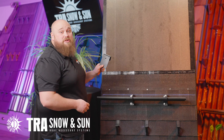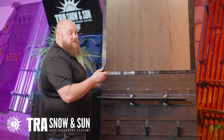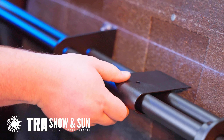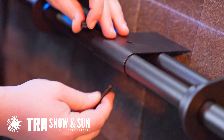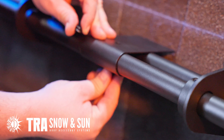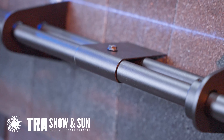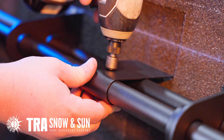And for those who have purchased ice flags to mitigate ice underneath the pipes, install with the longer edge uphill. And your bolt and nut with your bolt on the downhill side.